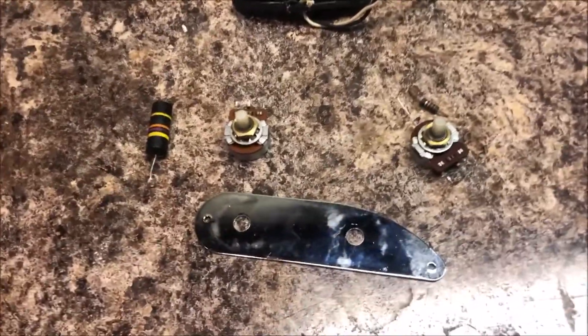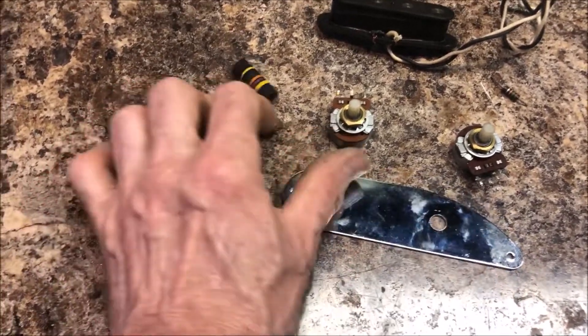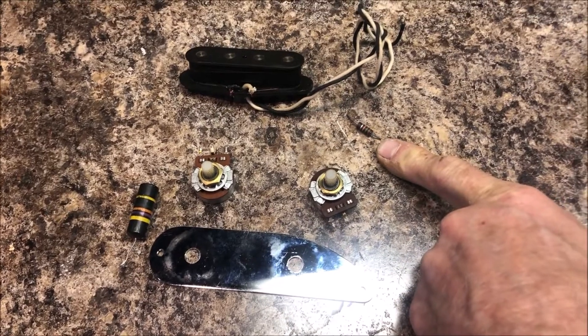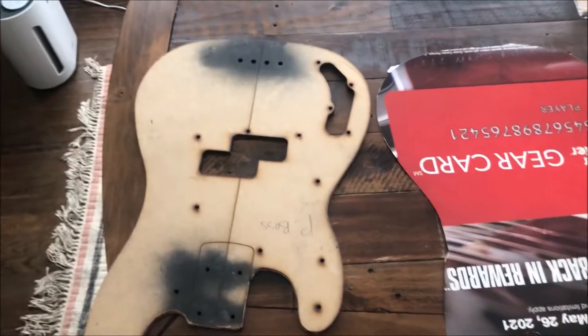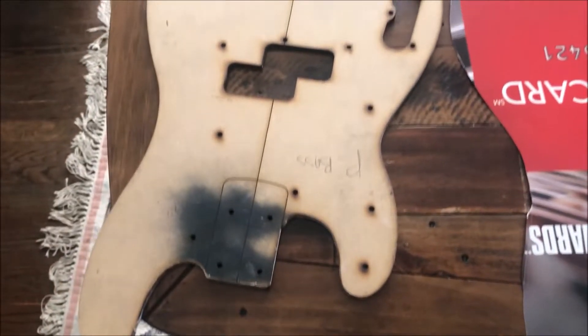While I'm letting glue dry, I thought I'd assemble the electronic components. In the original wiring, they got two 250K pots, a .1 bumblebee cap - look at that, a bumblebee! - and a 15K resistor. I've seen some controversy about that - I can always take it out if the Sweetheart of the Blues doesn't like it. Let's get to wiring this up. One of the perks of working at Guitar Center is I get free poster board for my crazy projects.